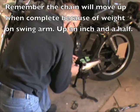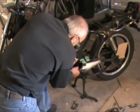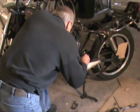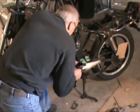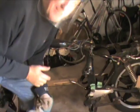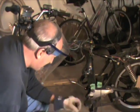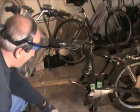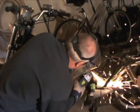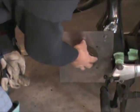Now I must bring this up and off to clear everything underneath. I must also make sure that the chain down here comes at the right point so it clears and doesn't hit any metal. I'm going to do a center line and then the two outsides, and I'll put the chain on to have a look. We're ready to grind this here — if I grind this little plate off a little bit down here I'll be nearly central. I can put the plate mounted on this side. For lining purposes, I put a bolt here and here, and now I can put my motor in and check if it's in line.